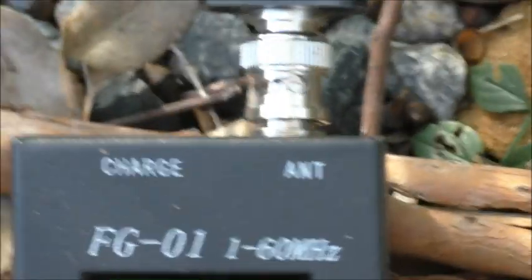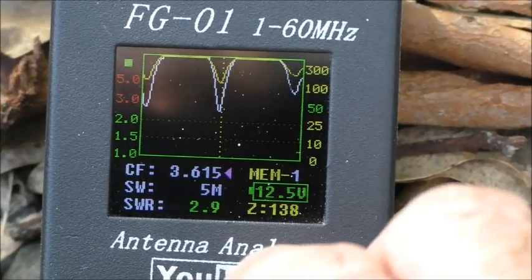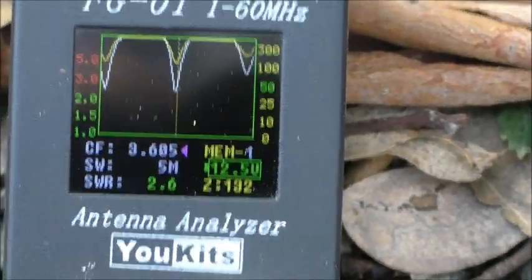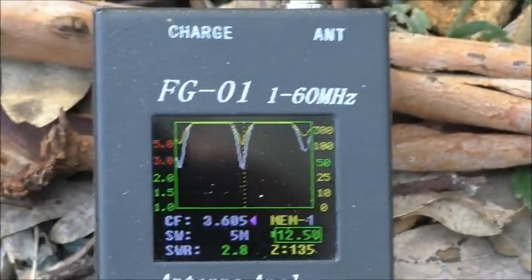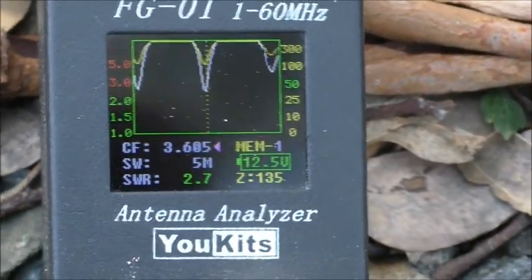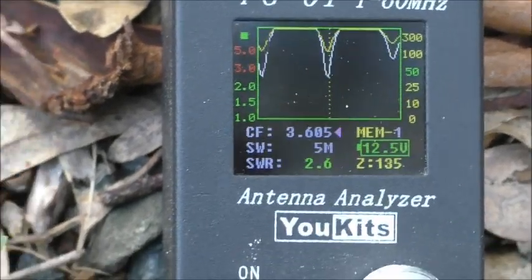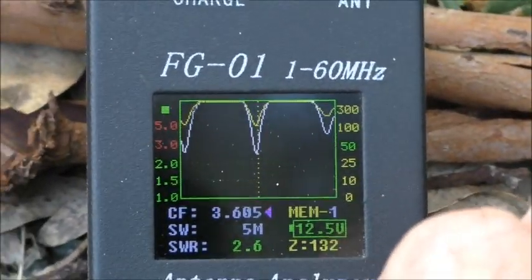So I've extended the length of the antenna to move one of the sweet spots to 3605 or thereabouts. That's not far off being optimized for 3605 — about 2.6, and it probably varies a bit with the weather and ground conductivity. As you can see, I've moved one of the sweet spots onto 3605 so now the SWR is only 2.6 to 2.7 and the impedance is 132 ohms. The antenna is now more like a 5/8 wave in length, and the automatic antenna tuner has a far closer load impedance to match to 50 ohms, which will reduce the voltage across the output of the ATU — which can only be a good thing.